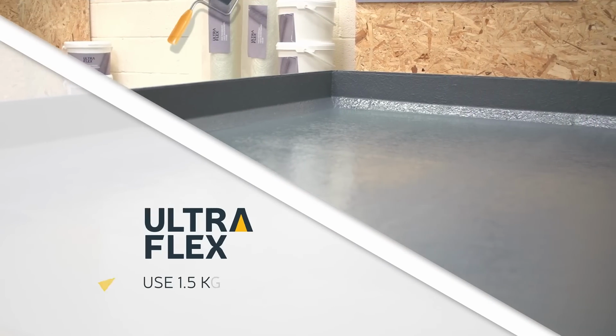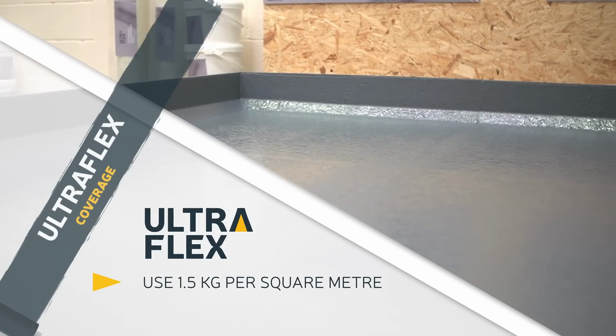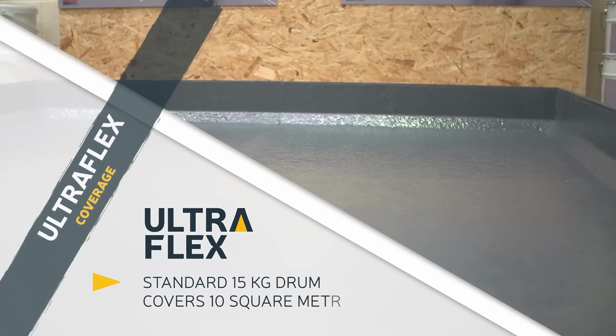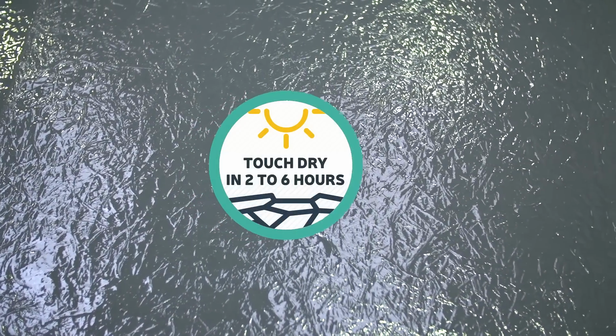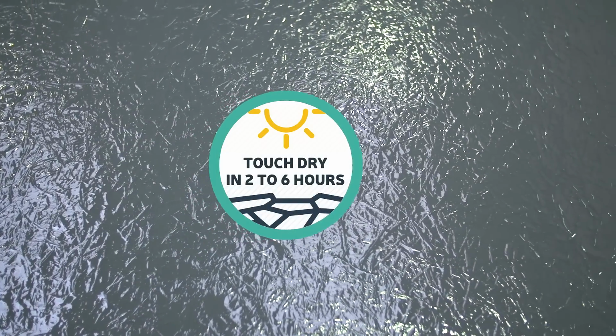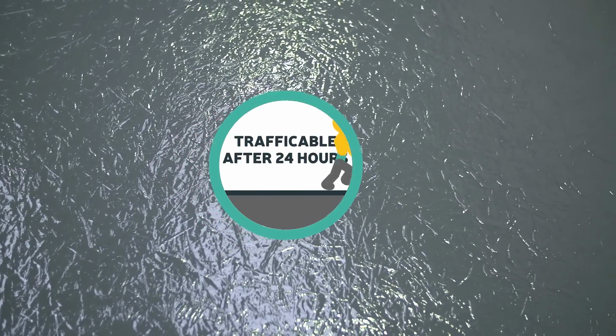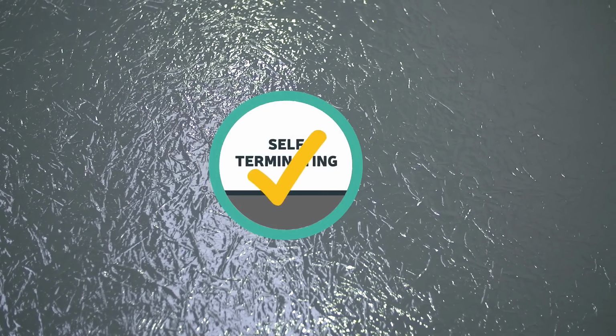Overall, you should use 1.5 kilograms of ULTRAFLEX per square meter, meaning that the standard 15 kilogram drum will cover around 10 square meters depending on the substrate. ULTRAFLEX will be touch dry within 2 to 6 hours and is fully cured in 24 hours, at which point it is fully trafficable. ULTRAFLEX is also self-terminating.